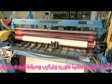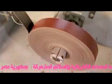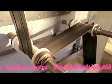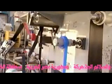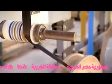Over at the splitter machine, small round knives slice rubberized cotton the same width as the rubber strips. Then a mechanical puller unrolls material from 4 different spools. There are 2 streams of rubberized fabric, 1 stream of the synthetic rubber, which came out of the extruder earlier, and 1 of rubberized cable wiring.